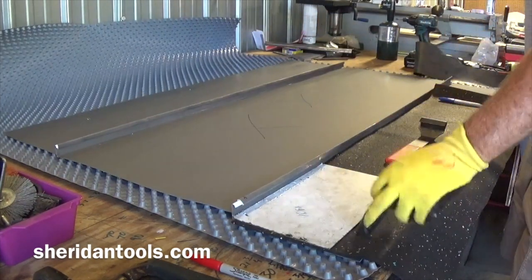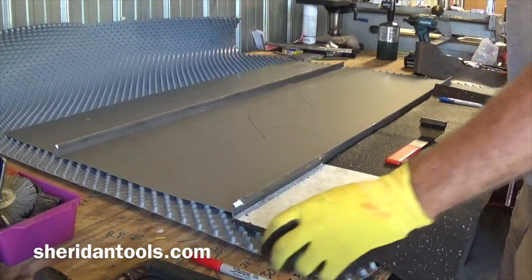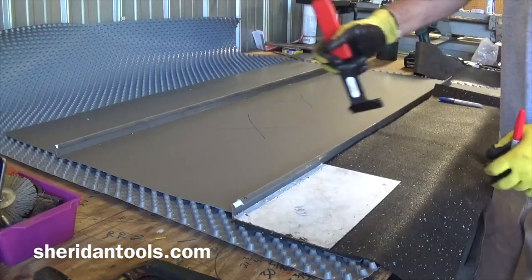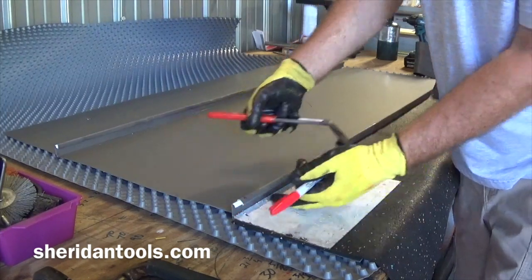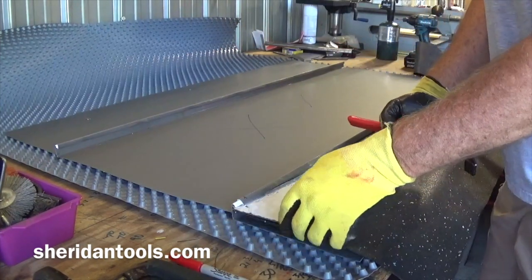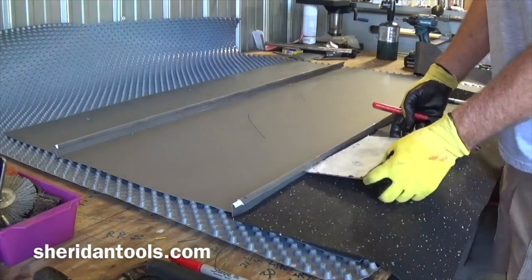We're trying to protect the panel that this is sitting on, so critical area is going to be the vertical part of the standing seam. You don't want this to be dragging up that side. Just want to catch this lip right here, your very first part of that seam that you have to unlock. You don't need to go any lower than that.